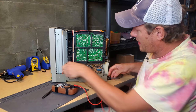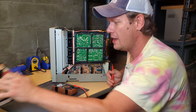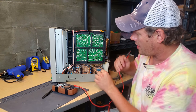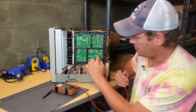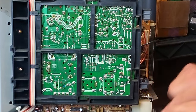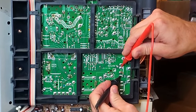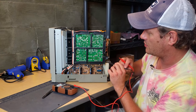So let's go ahead and roll our Sony PVM-1343MD over here and go ahead and test it. We're going to look at the backside - this is, again, the same power supply. But the fuses will be on the back now. We can check right here at these points. So if we look down here, this is where our power connection comes in on this F board. And this is the first fuse, which is the glass fuse. Let's go ahead and test it. I'm going to put a point at each end. And we have continuity. So that means that fuse is good.